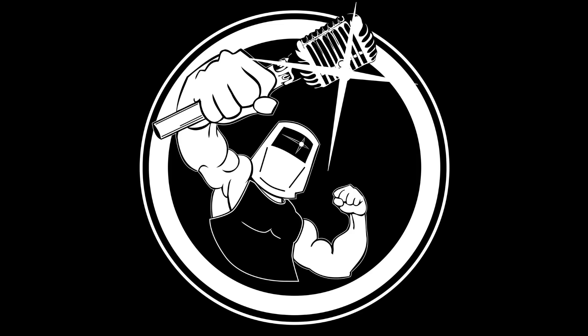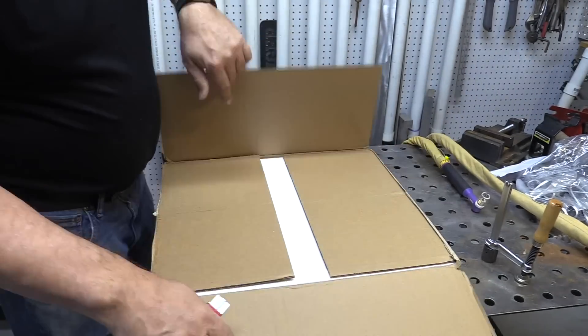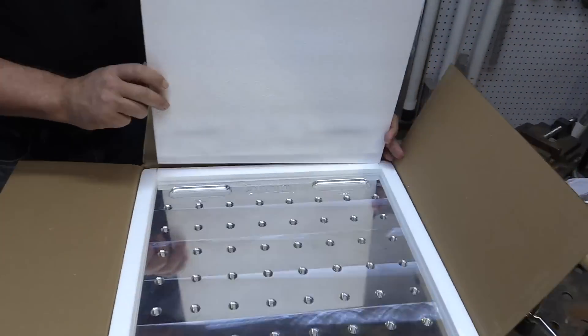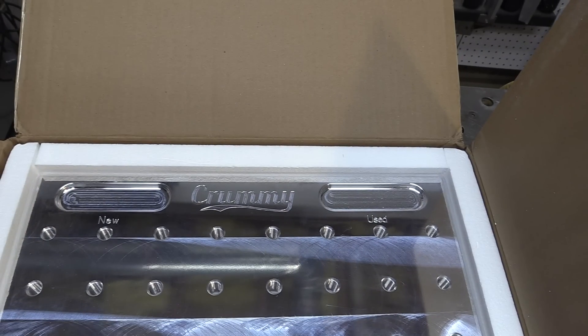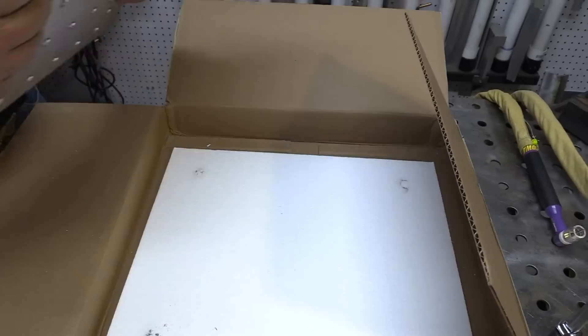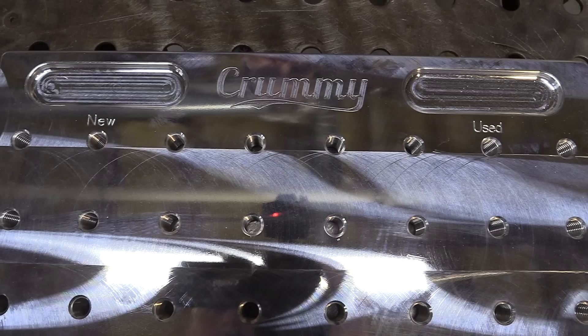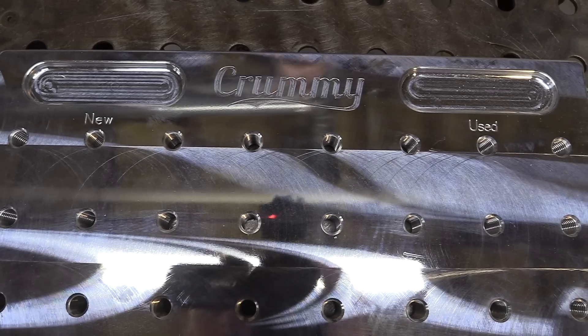On one of the recent episodes of the Welding Tips and Tricks podcast, we talked about modular fixturing and this aluminum fixture plate that Roy had several of made recently. I got one of them because over the years I've done so many small jobs for machine shops where this would have come in handy — the ability to have a big flat machine surface, a heat sink, as well as hold-down holes (half by 13). This is a one-inch thick chunk of 6061 aluminum with indexed holes, a place to put new and used electrodes, and it looks cool and works great.